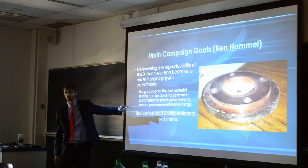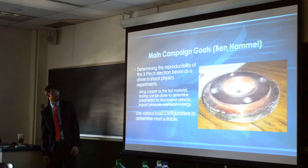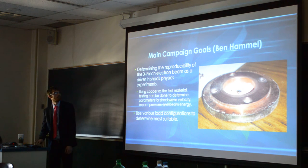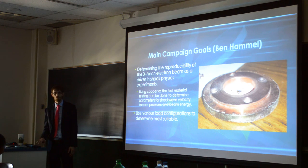This is the final target. We're using polycrystal copper. That one's about 4 millimeters thick, and you can see the electron beam blew about a 2 to 3 millimeter hole through the middle of it — actually 4 millimeters of copper, the electron beam just completely went through it. And there's actually no warping on the total surface of the target, which kind of tells you that the electron beam is going at that 100 nanoseconds, and there's not a whole lot of heat transferring between that and the target.